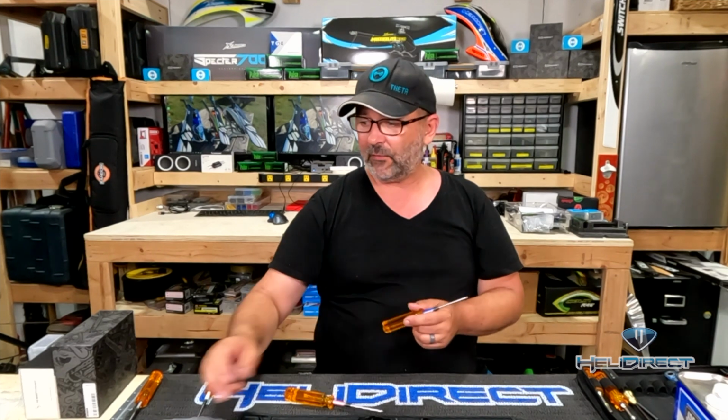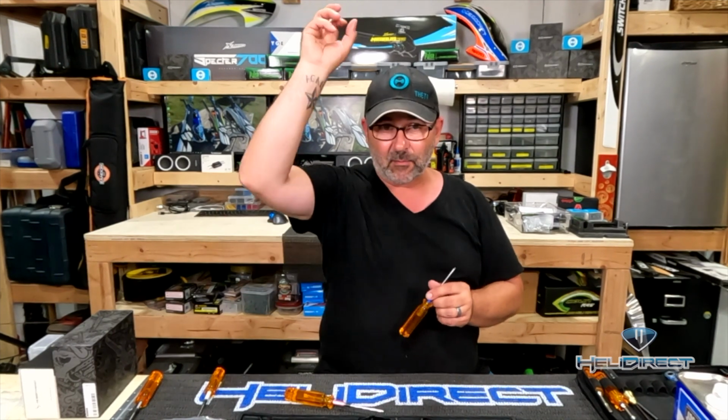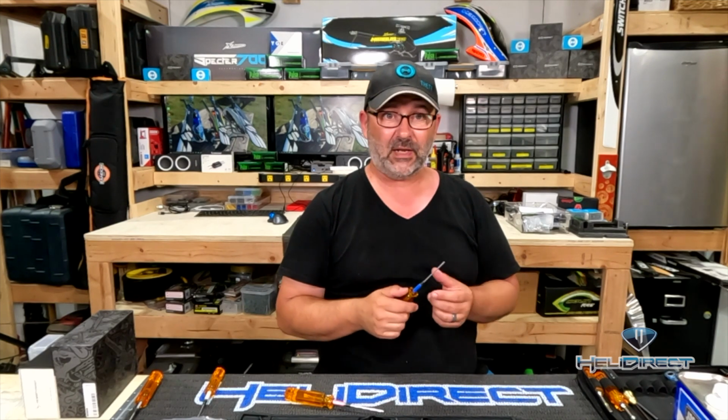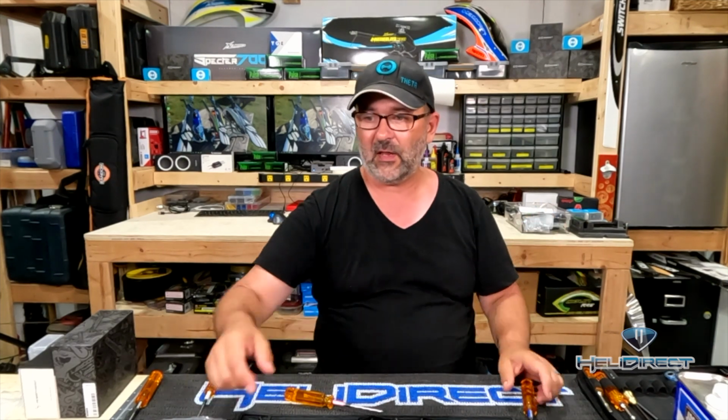This particular bolt that we just cleaned is what holds the main rotor hub, so your main rotor disc on the helicopter. It's what holds it to the top of the main shaft that it revolves around, right? That bolt backs out, the entire head of the helicopter comes off. You have a spinning, basically circular saw blade, but bigger, going off in one direction, and your very expensive helicopter falling to the ground to break in another direction. So obviously thread lockers are very important.